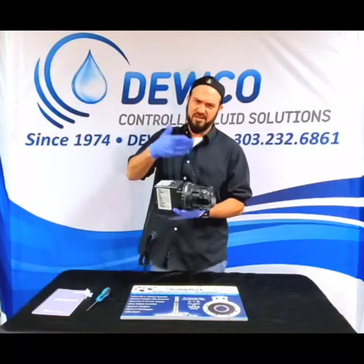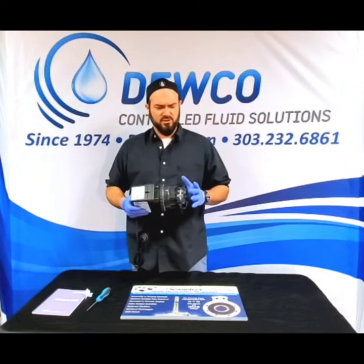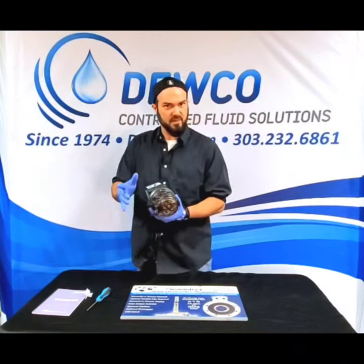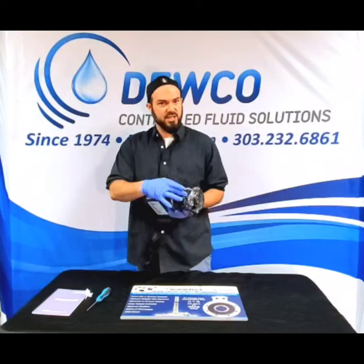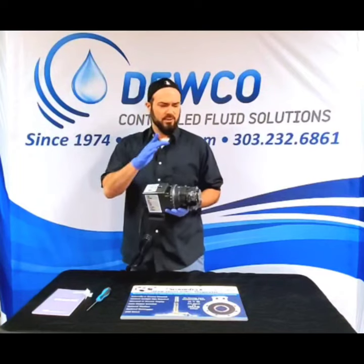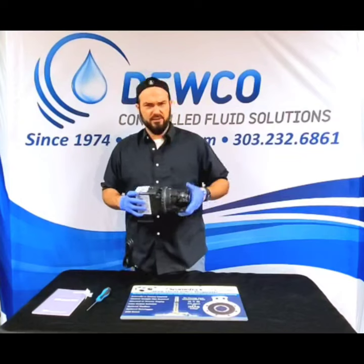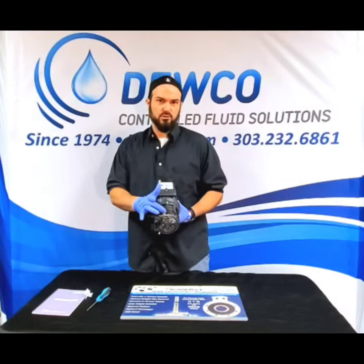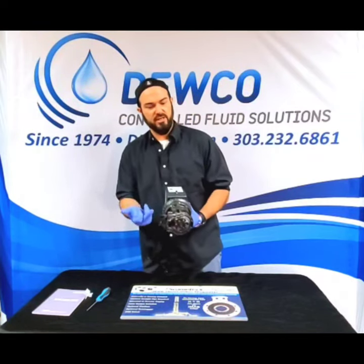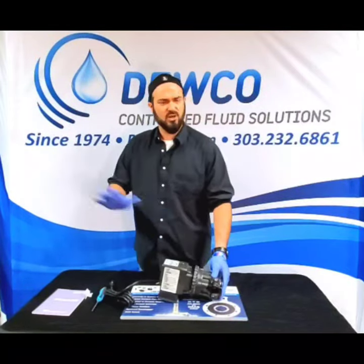One thing to make sure of — the main way to determine if the roller assembly is properly expanded: if you do not see a teardrop formation on the pump tube as it's rolling, your pump tube is either compromised, you need a new roller assembly, or you just didn't expand it properly. When the roller assembly is pressing the pump tube to the inner wall of the housing correctly, you'll see that teardrop shape. Boom — you see a teardrop, you know you're good to go.